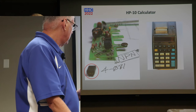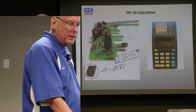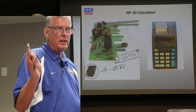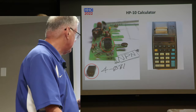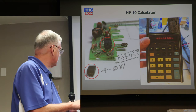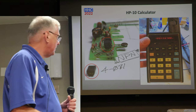So that was my display after the transistor was broken off. I didn't realize most of the leads were broken. And my power supply was trying to supply about a half amp of power. Thankfully, I'm thinking, I just fried Gene's CPU and it doesn't work anymore, right? Well, the good news is a little bit of work, new transistor, and all the display comes back again. So I replaced this and put the PC boards underneath it just to make sure, and powered it up off the bench power supply, and it looks great.